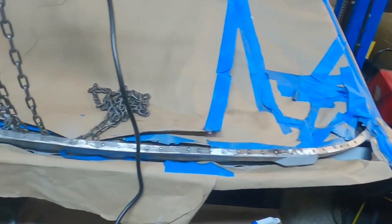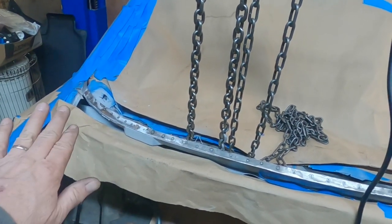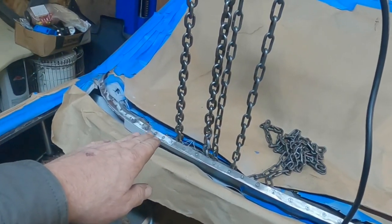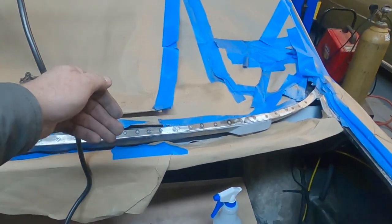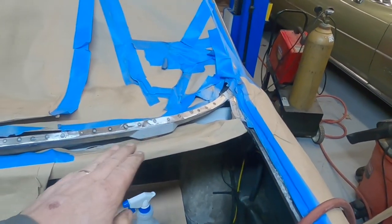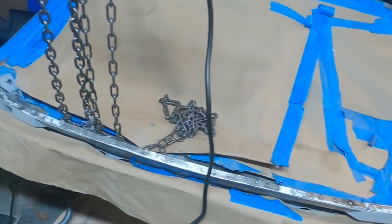I think I'm going to go ahead and end this video right here, folks. The only thing I have to do on this upper part is make that little patch right there, and that's just kind of mundane — very similar to the other parts of this project. So as we went along, we had to clean up the contact points to make the spot welder work. Clearly, you have to have good electrical connectivity on the back side, the front side, in the middle, all that stuff. It was a little haphazard — it didn't just go zip zip zip like that. We had to take some time, make it connect, engage it again, do another spot weld, move the clamp, grind it down a little bit, clean up the connection, zap it again — so on and so forth. But we got her done.